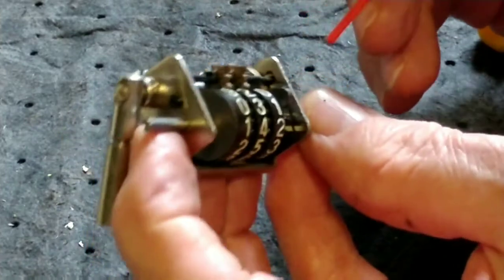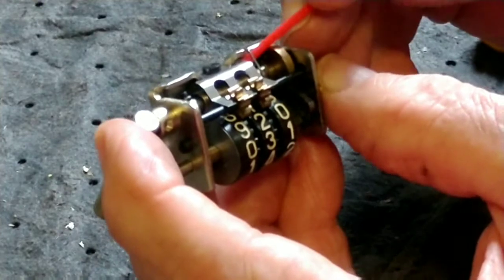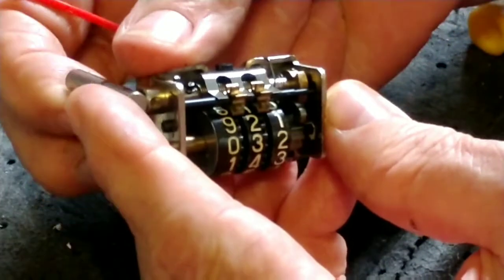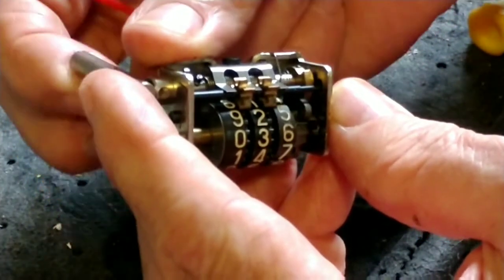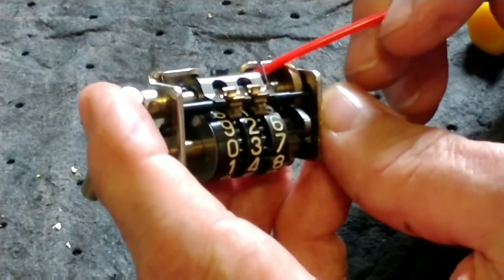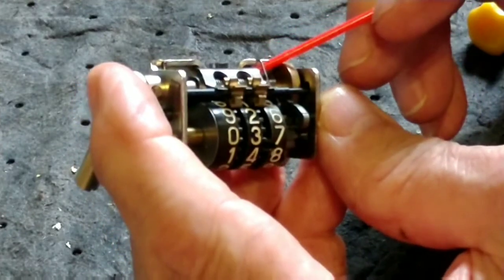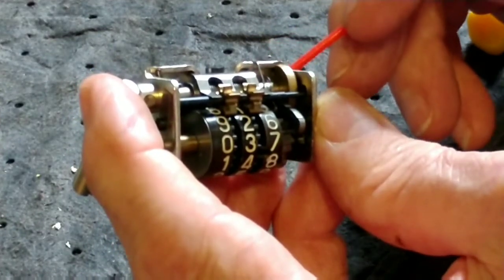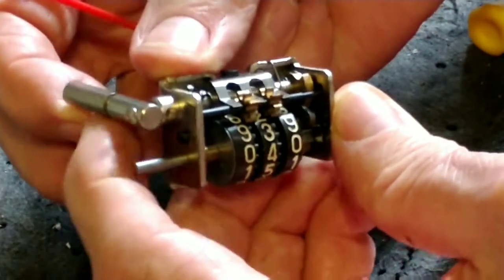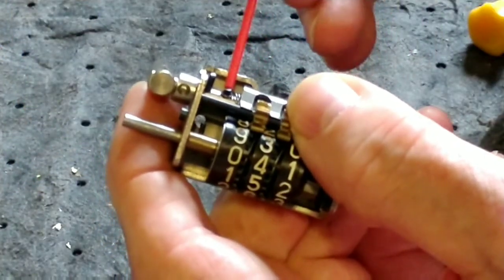Also want to point out right here, here is the spring end. You can see the straw behind it. We can. That is actually controlling the tension on the rod. Now that spring, that's a fragile little thing. Well, again, spring steel's tough, but a little bit of corrosion on the tip, and this could be broken and flipped over inside of there. And again, you're not going to know, why is my row counter not working? Mm-hmm. And this is a positioning screw here.